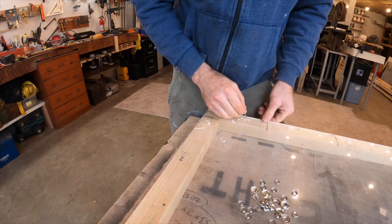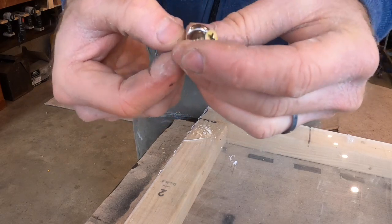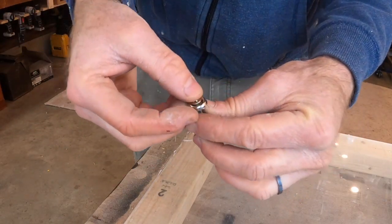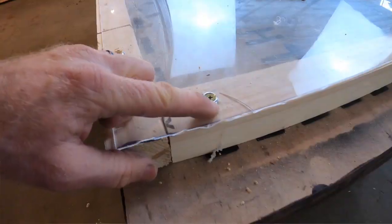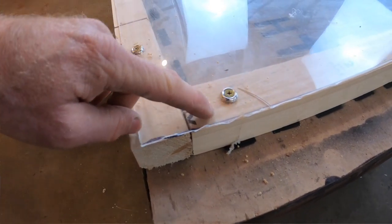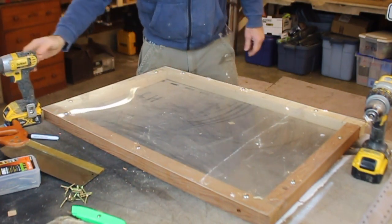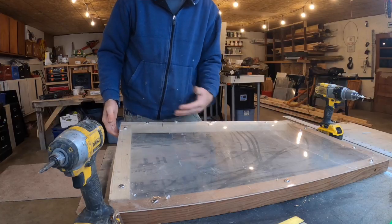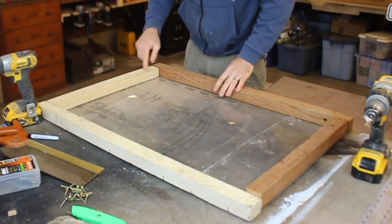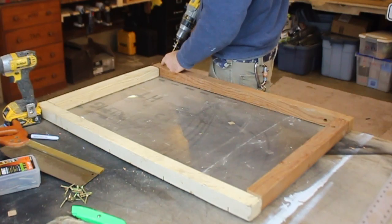Without finishing washers, the screw just won't make a nice connection with the acrylic. With the finishing washer, the screw sets inside it nicely, and the whole thing provides even pressure on the acrylic and holds it much better — the finishing washer exerts force in a circle around the screw instead of the screw head itself contacting the acrylic. Next, stiffen up the frame: the different pieces of wood aren't really attached to each other yet, just sitting there attached to the acrylic. Flip it over and run some screws between the pieces. Pre-drill the holes at least halfway through so you don't split the wood.